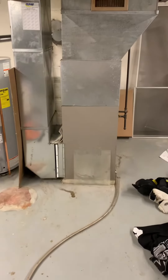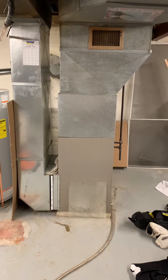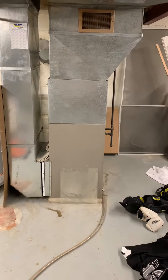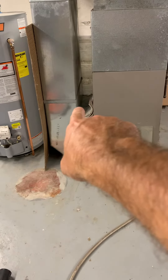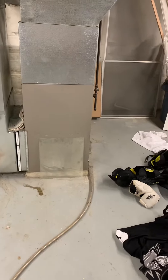Alright, looking at replacing either the full system or AC and coil. We're going to gain a little bit of ground with our furnace — it should only be 17.5 inches and this is 21. So we can look at coming straight down again with our new drop. We've got 5 inches currently and we'll gain another 3.5 basically for the furnace.